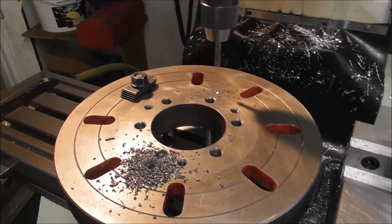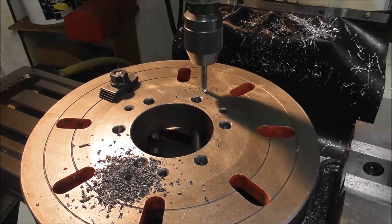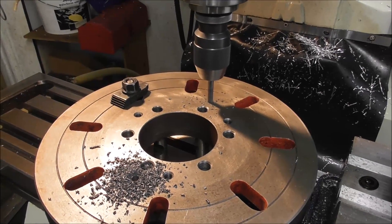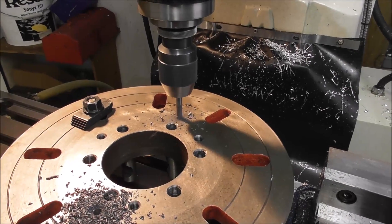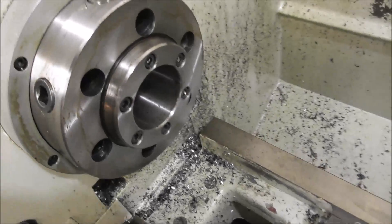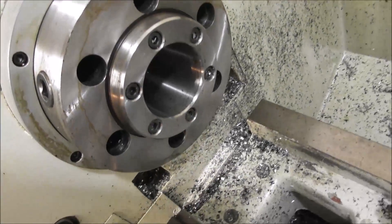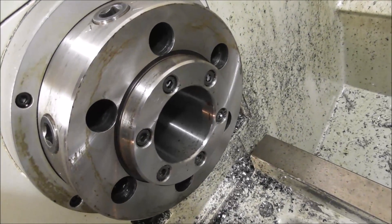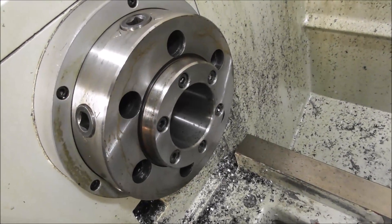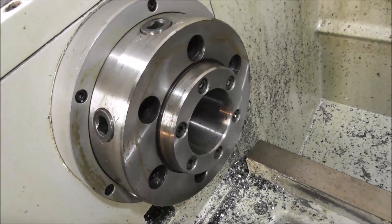For most work, there's no need to drill and tap a massive hole — a 10mm or 3/8 thread has got a huge holding force and will weaken and unbalance your faceplate a lot less. I hate this damp lower hut environment; I run a dehumidifier and keep everything coated with different protectant sprays and still it creeps in on my beautiful machinery. If you've got any magic solution, put it in the comments.